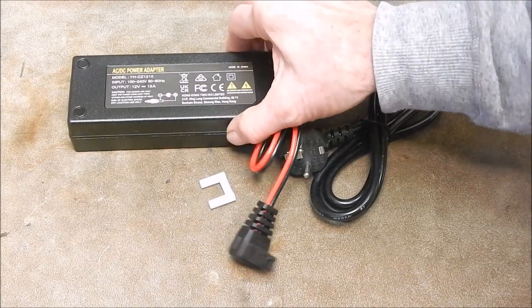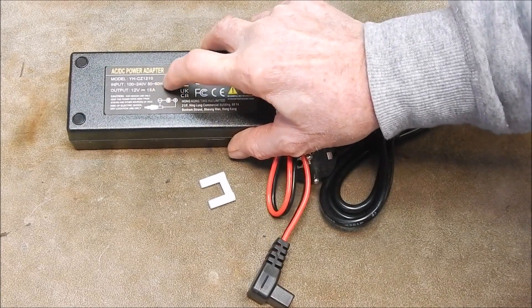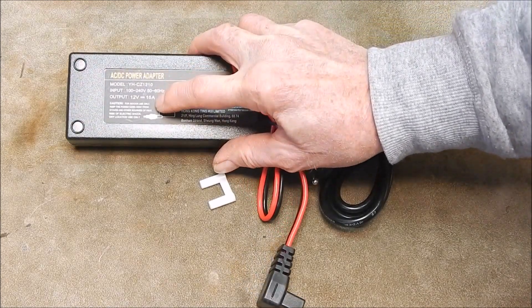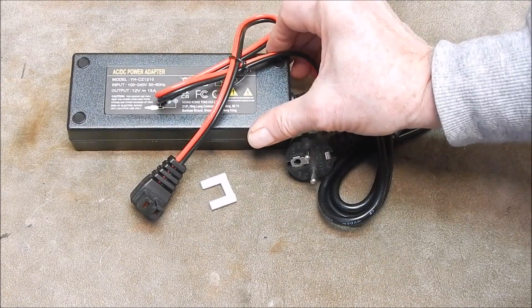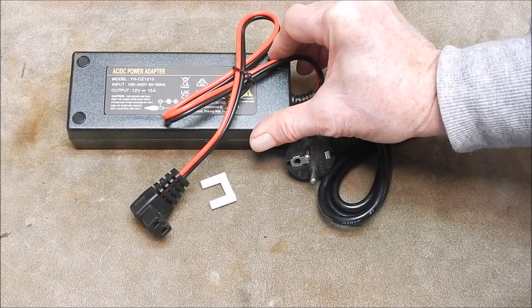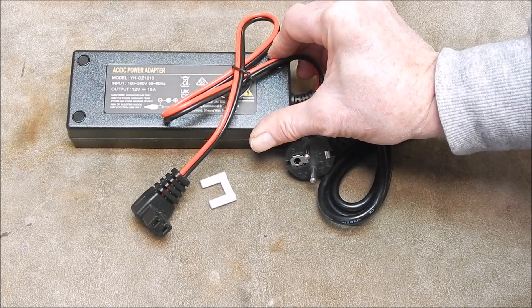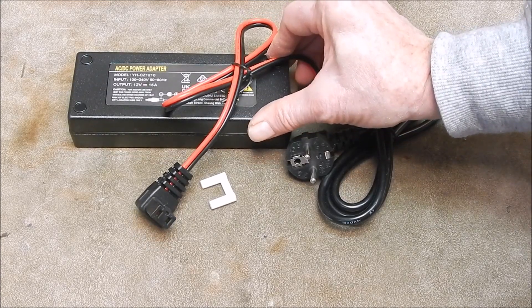As far as the AC voltage, it's just automatic input — 100 to 240 volts and 50 to 60 hertz. The output is 15 amps they say. Rated output is 110 watts and peak is 180 watts. As we're asking for 135 watts, it's well within the peak range so it shouldn't have any trouble meeting that. The glow plug is only using 135 watts for a very short period anyway, so I don't expect any issues — it should handle that quite OK.